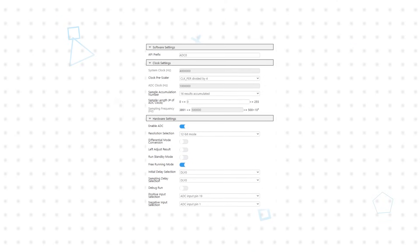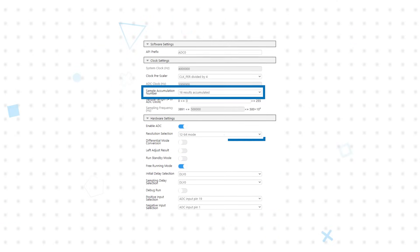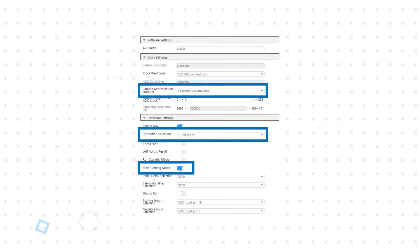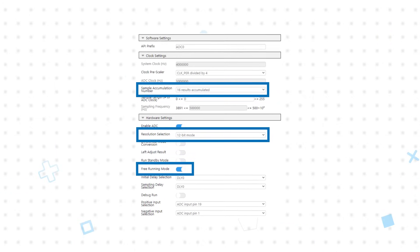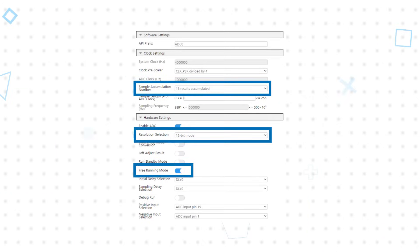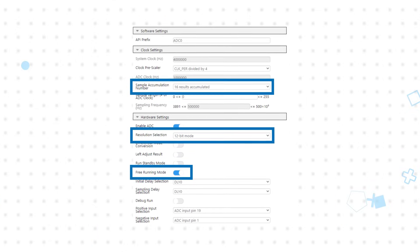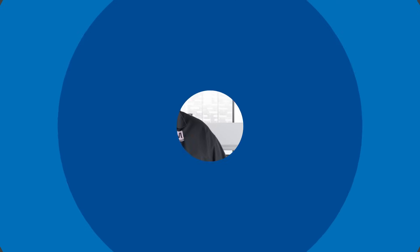In the pressure demo kit, the ADC and UART CIPs in the AVR64DD32 are being used. MCC is used to configure the ADC for free running mode and to accumulate 16 12-bit results in the 16-bit accumulation register. The ADC internally averages these 16 measurements and reports the average for a smoother reading. There's also a setting to run the ADC while the CPU is in standby mode, which can reduce power consumption, and the event system peripheral allows multiple peripherals to communicate with each other and perform tasks while leaving the CPU in standby mode.